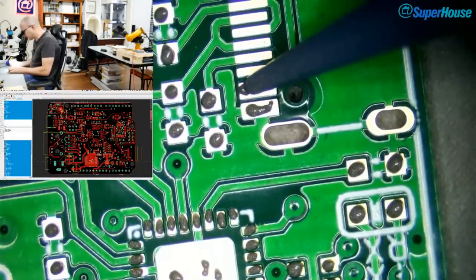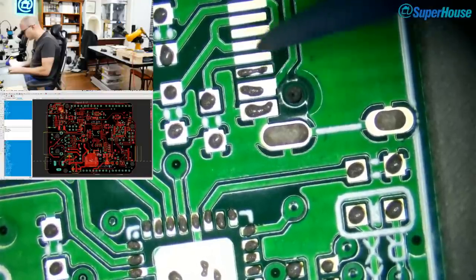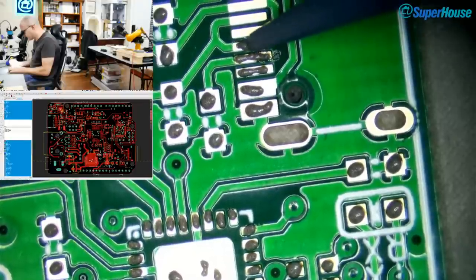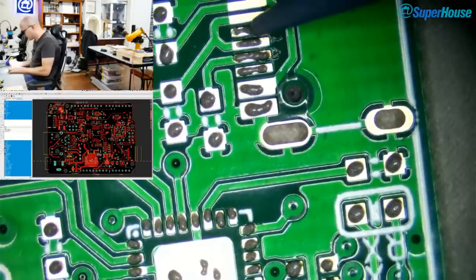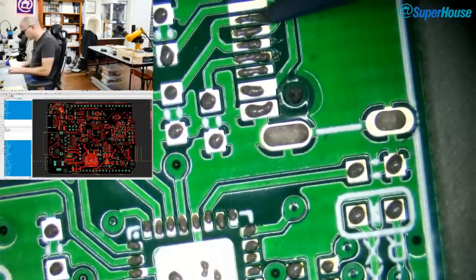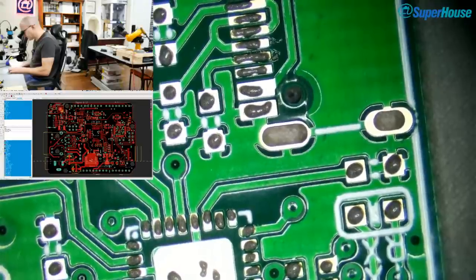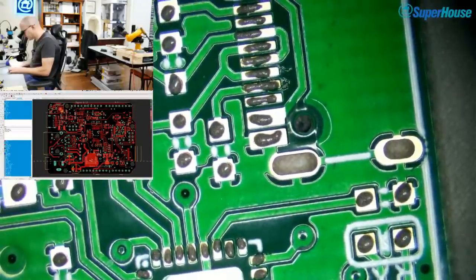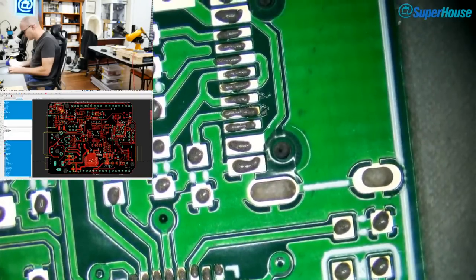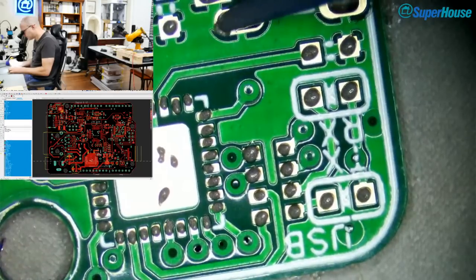And I also do the same thing on this. So this is the USB-C connector. And the other thing is that I could just run a bead of solder straight down across all of these pads. That's what I used to do, and recently I've started putting paste directly on each pad like this, and it's all going to smoosh together when it reflows anyway, so I'll just squirt a bit in here, that'll give it a bit of mechanical mount.